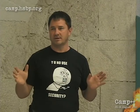What I really hate is the bump technique. I never speak about this technique. We never sell any key for the bump technique. It's really a very strange and very dirty trick. If you see a lock and you have a key for that lock, then you can modify that key to open all the other locks of the area. In the low and middle price segment, when you see the high price segment above 150, 200 euros, you cannot open with the bump technique because of other closing elements in the lock. But if you see a normal pin tumbler lock, even if it has only the simplest straight pins or security pins or any kind of pin, you can open 90-95% of all the locks with this stupid technique.